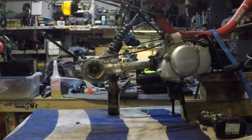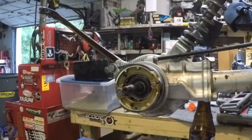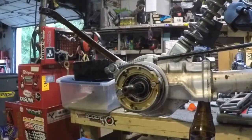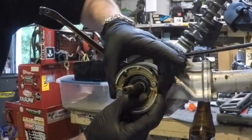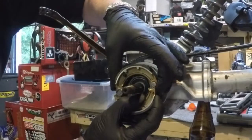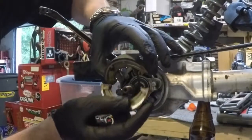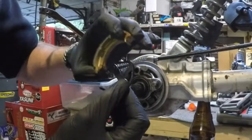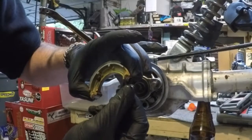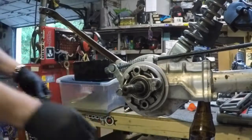For the next step we'll need to remove the brake pads. I'm going to get in a little closer so you can see exactly what I'm doing. The way I like to do these particular pads is to just unseat it from the pin and then just roll it forward. There is a spring on the back side that's spring-loading it and then they just both kind of pop into place. You can see the horseshoe shaped spring goes in the hole there. We'll set those aside for reassembly.